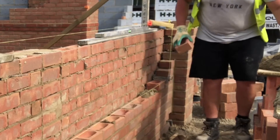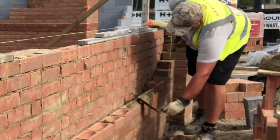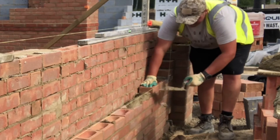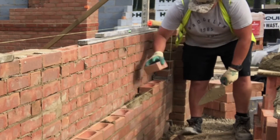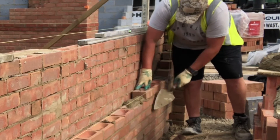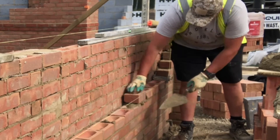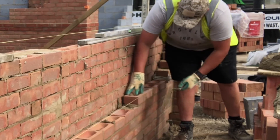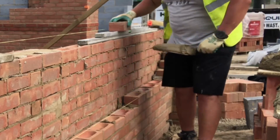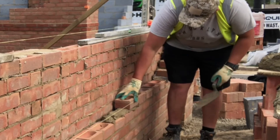The other reason I take it that high is to minimize the topping-off work on scaffold. Say you've got a boundary wall with 30 bricks per course times two skins plus pillars — about 70 bricks a full course. Then brick on edge: 35 times three is about 105, so only about 250 bricks total to lift onto a scaffold plus a few packs of tiles, and you've finished the wall. That's doable in a day.